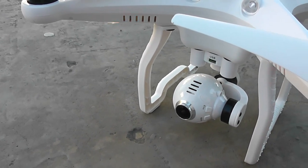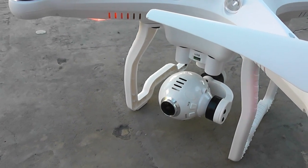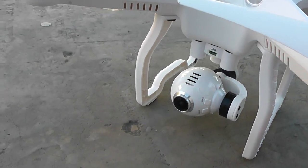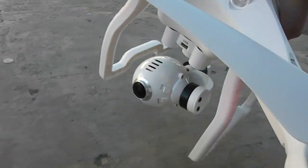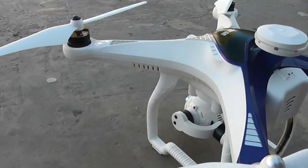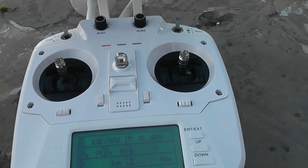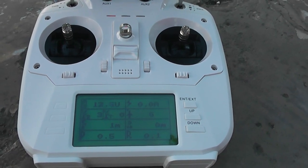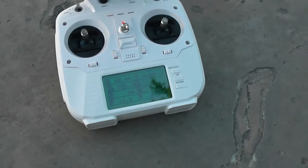That's good news. The gimbal is a 2-axis one from OM, the 2-axis version of the Wingsland Minivet, which is a 3-axis one. So you also get the same software to calibrate the inertia, and it's working very well actually. I just did the compass calibration and everything is okay. So I will wait for the reception of all the GPS information. Actually, I'm receiving up to 7 satellites.